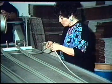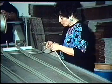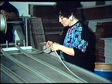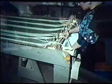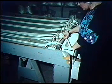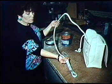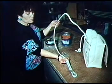Quality control is assured because each line is hand and eye inspected. Workers can feel and see any imperfections or fiber variations. After inspection, the lines are cut to the length desired by our customers and placed in special bags. The line is cut with a hot knife to prevent unraveling. A rubber protector is placed on one end of the line and aluminum ferrules are placed on each end and swaged to secure the thimble and provide a strong connecting point.